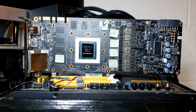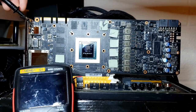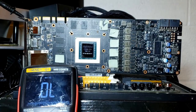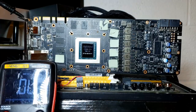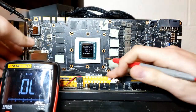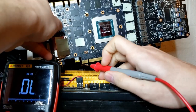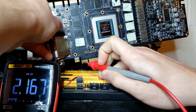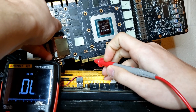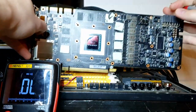The first thing we want to do is check the base voltages for this card. We'll hook up our multimeter in diode mode or continuity mode and we'll check if anything beeps. First we're going to start at 12 volts — the first three pins on this side are 12 volts. Not short. Then we want to check 3.3 volts — you start from this notch and go four pins left. Not short. So that's good.